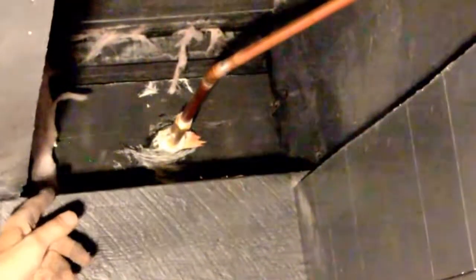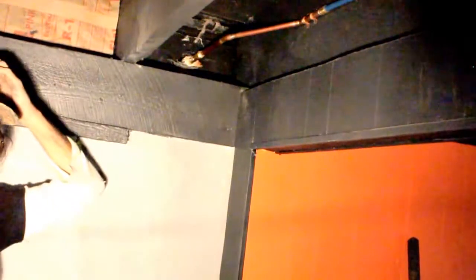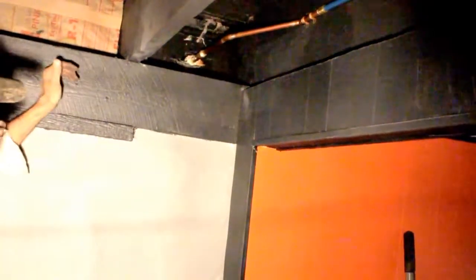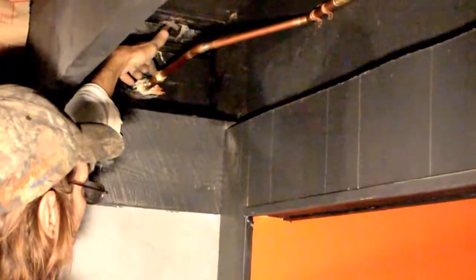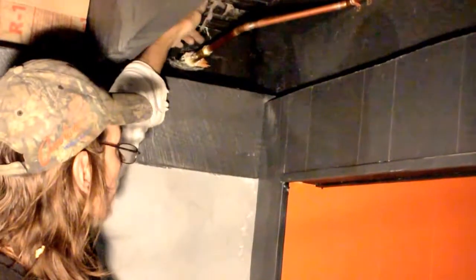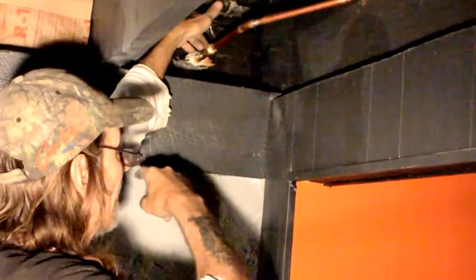Frostproof right here. What that does is the old style hose spigots, actually the seat where they shut off was right at the valve. So what would happen is they would freeze up and they'd break in the wintertime. You have water spraying everywhere. So what these do is they've got a tube. Your seat is actually back in here. The handle that turns it off has a long shaft in it that's inside this housing, and your actual rubber seat that shuts it off is back here, not way out there.